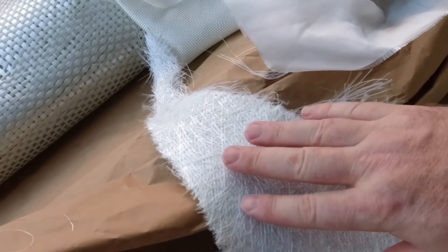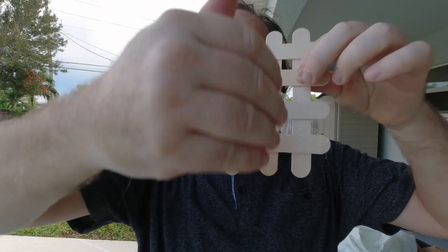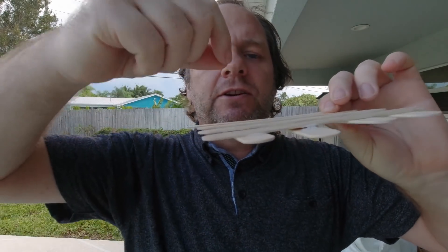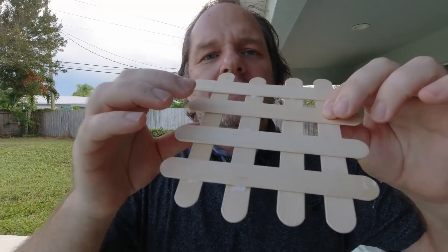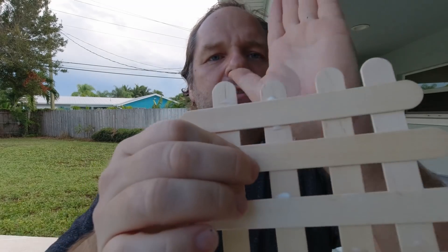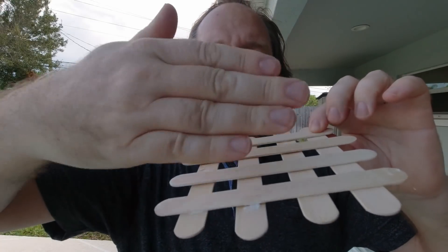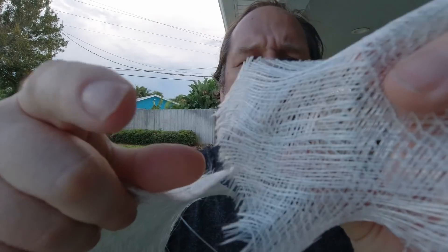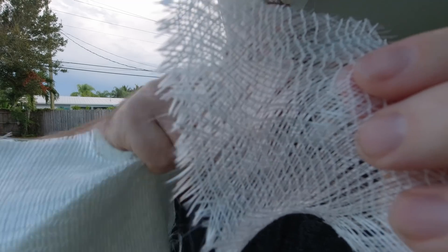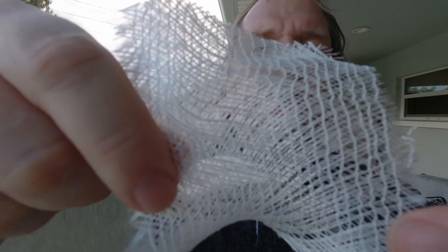This is my model that represents knit. It has all of the strands going straight, not weaving through each other — in the same direction. Typically they're sewn together with little threads that knit them together. This would be considered bi-axle because it runs in one direction and also in the other direction. You can get unidirectional — basically a flat plank of strands running one direction — or bi-axle, or tri-axle. This here is a very lightweight, probably three or four ounce bi-axle cloth with strands running 45 degrees to each other — bi-axle 45 on 45 — with thin lines sewing it together. This you really wouldn't use on a boat — more for surfboards, models, or maybe some interior work.